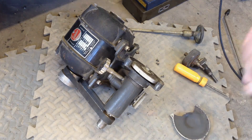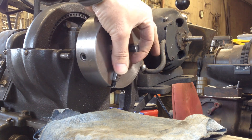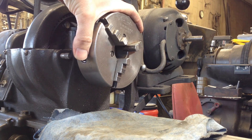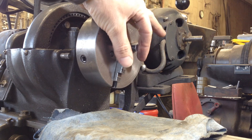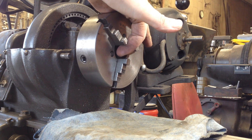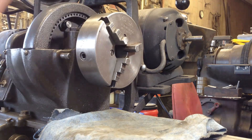I really would prefer to use this on there. The real kicker is I don't have a good way to hold these jaws under tension. I was going to use the plate idea where you drill three holes in the plate and slide it over these jaws and then bore it out. If you know anything about what I'm talking about — I decided that was really the best way to go. That would be really nice, but I just never took the time to make that plate, and that plate really needs to be accurate.